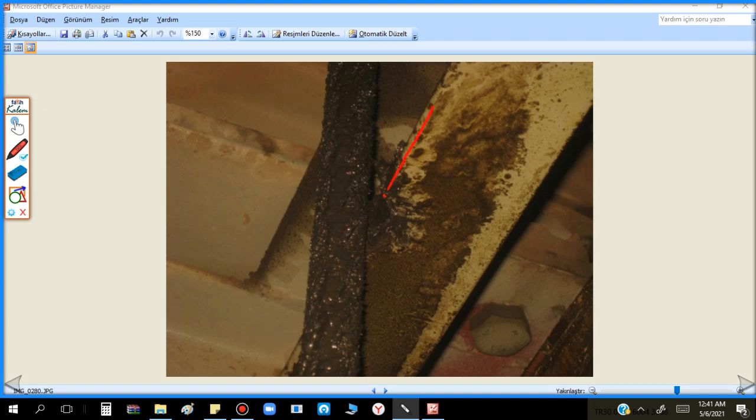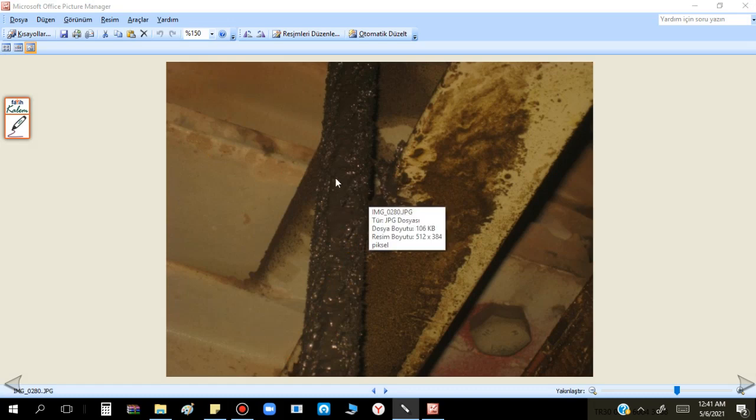You see the foundation is already eaten too much. This wire - it is reducing the lifetime. My friend, if your cargo wire, the hoisting wire, is broken, most probably as I told you it will be broken 99 percent when lifting the grab the first time inside the cargo hold, so there will be nobody there. But this is a gamble - you don't know when the luffing wire will break. If it falls at any time, the entire crane will fall. This is very, very dangerous, my friend.